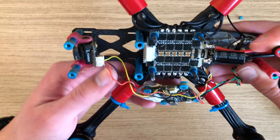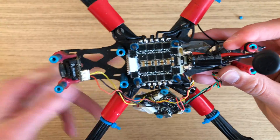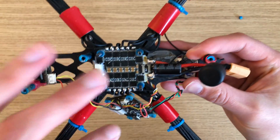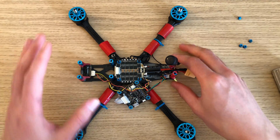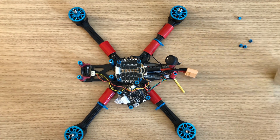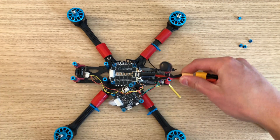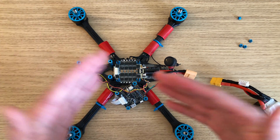I've popped the flight controller off the top and we can give it a visual inspection a little bit closer, but I'm still not seeing anything. A lot of times you won't see anything — there's just something at the microscopic level going wrong. To be more sure, I've unplugged everything from the ESC except for the motors, removing the camera, flight controller, and video transmitter from the equation so we're isolating the ESC as best we can. Same result. So at this point I'm 90% sure it's the ESC, and we're going to replace it.